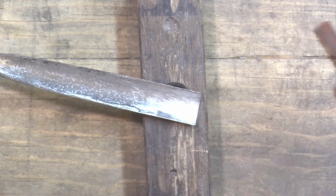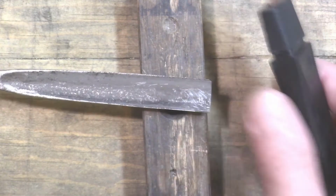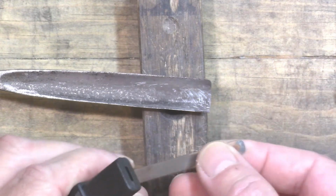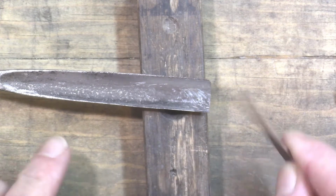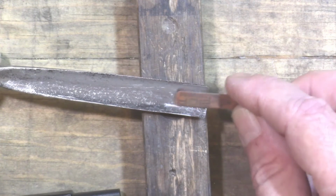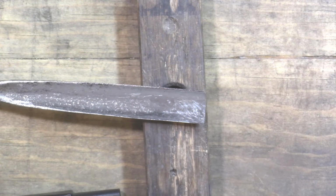It only matters down there that you've got a clean polish with no pits for the cutting edge to work properly. But yeah, I got out one of my mold and die polishing stones. It's a 320 grit, and I put a little bevel on it with the diamond file so that it matches the contour a little better there. And I've been working it toward the end, of course, and going this way, but on the interior areas, it's up at an angle working on this bevel. And as you work, the stone kind of wears its way into the shape that you need.